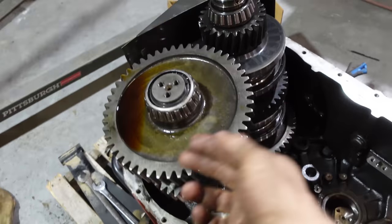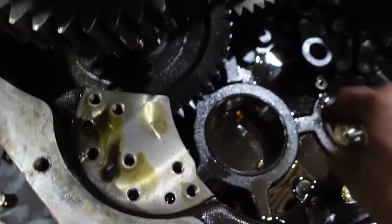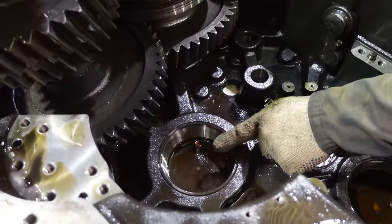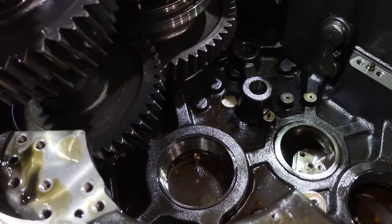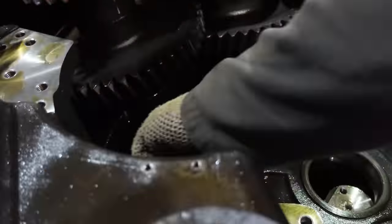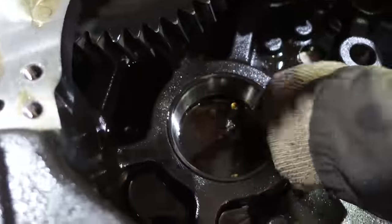Okay, so to get that out, you just tilt it. Oh, no, those are bolt heads. Okay. You tilt that over until this one just clears here, and then you can kick it over and get it out. It's kind of a crappy way of doing things because you will leave some lines on the bearings, but they're just little marks.